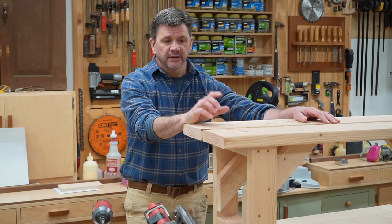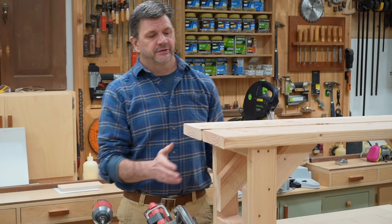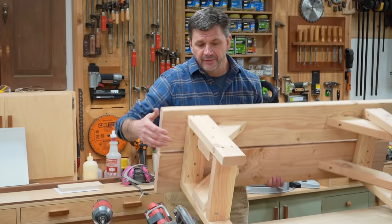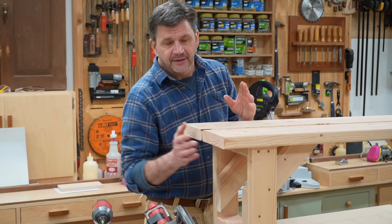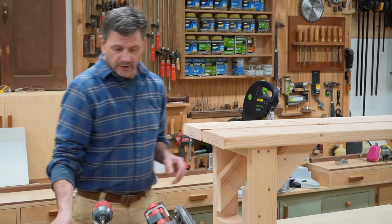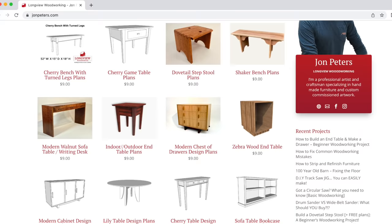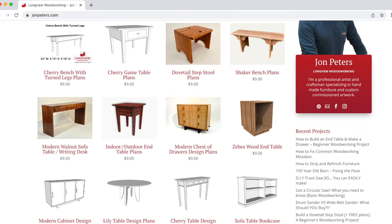That's a good solid bench that didn't take too long to make, and I think it would look good on any deck or in the garden. If you're going to put it in the garden, don't just put it in the dirt — put a paver or a brick under each leg. It's also a good idea to paint the end grain at the bottom of the leg and maybe even add a plastic dome. That will elevate the wood off the ground just a little bit, allow for air circulation, keep the wood dry and from rotting, and help your bench last longer. Don't forget you can find the plans on my Facebook along with some detailed photos of the bench. If you're looking for more of a fine furniture build, check out the plans on my website — I'll have a link in the description below. I've got more than 20 professional plans on my site, all with video tutorials right here on YouTube. Thanks for tuning in, and I'll see you next time.